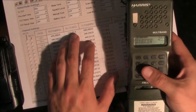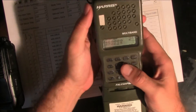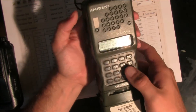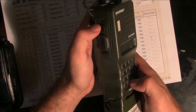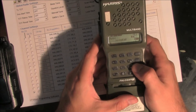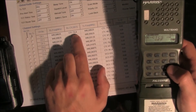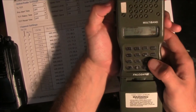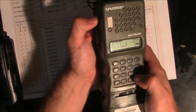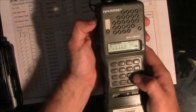First of all, I'm going to set a CTCSS tone for receive and for transmit. Because if I do the channel first, I will start hearing people who are talking right now, and we don't want that. So we are going to function — set the receive CTCSS. We've got channel 74.4 — confirm that. And we are going to set transmit CTCSS the same: 74.4. OK.